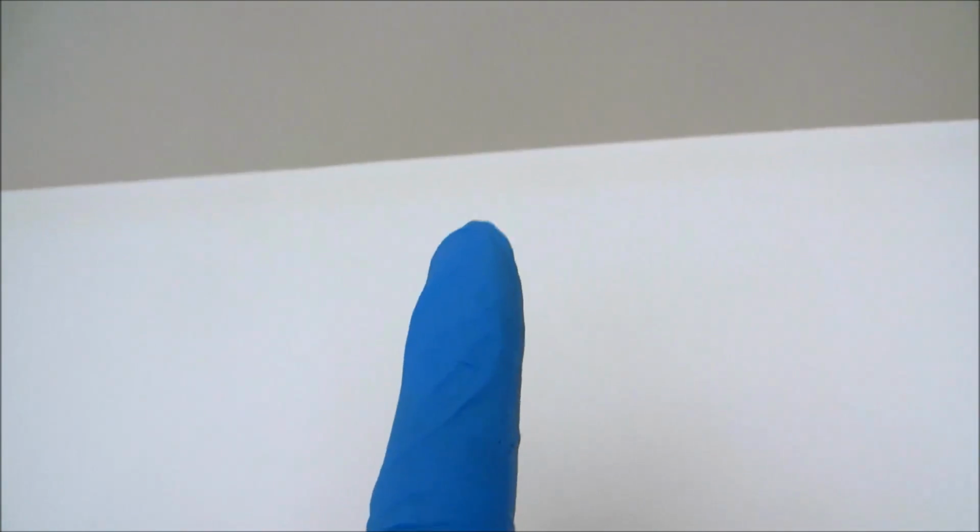There's a wire down there. I gotta be careful for that. There's the wall. I gotta open this wall up. There's my holes. I'll open the wall up so I can drill down through the sill, and I can run my pipe up and in, and my vent will continue up into the ceiling, into the attic. I gotta open up this side, and the way I can do it is from the other side.